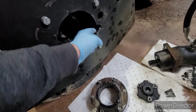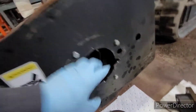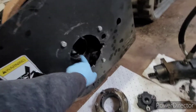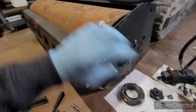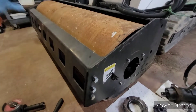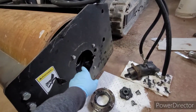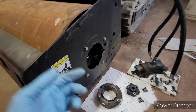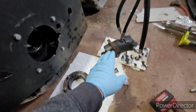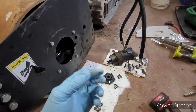Here's what I found. The way this drum works: there's an axle, two heavy-duty bearings — one on each side — and an axle that runs down the middle with two counterweights on it, spaced out in there. The hydraulic motor drives the axle and produces the vibration. In order to prevent damage to the motor, there is a coupling on there made from rubber — and that was causing the issue.